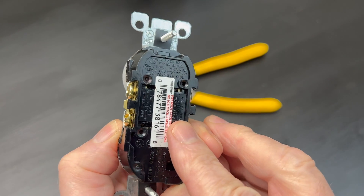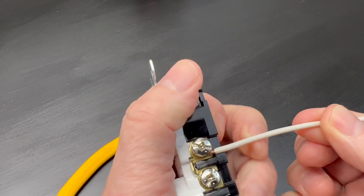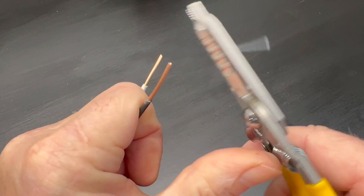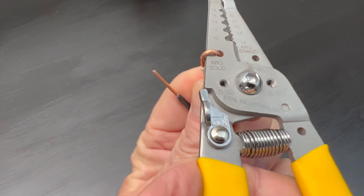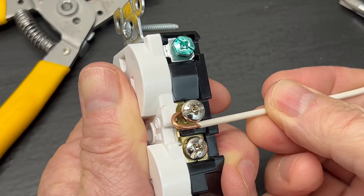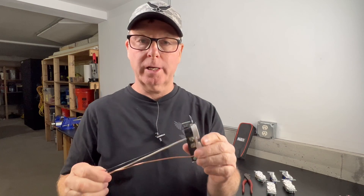The manufacturers also gave us a second wiring option on this device called side wiring. The side wiring method requires us to make J-hooks to connect to the side screw terminals on the device. We'll strip about three quarters of an inch of insulation off our 14 gauge wires — that's the right amount to make the proper J-hook. We'll bend our hooks by using the small holes in our wire strippers, or you can use the tip of your wire strippers. We'll wrap the hooks around the screw terminals in a clockwise rotation, and then we'll tighten down the screws. This provides a much more reliable connection and is really easy to accomplish with just a few simple hand tools.